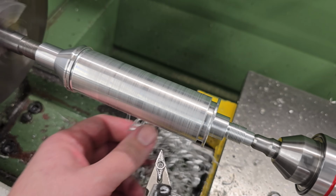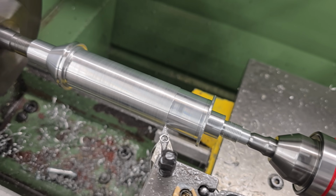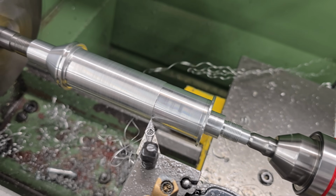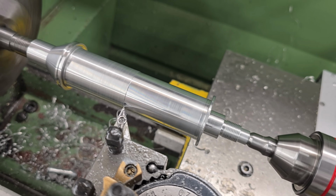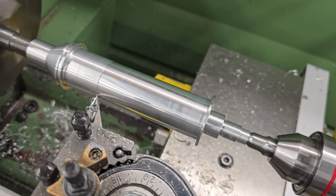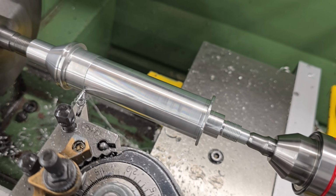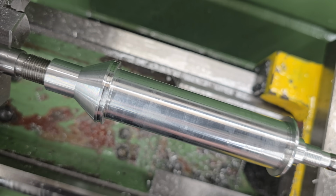shroud itself. In my experimentation with shrouds and moderators, the actual sound of the air hitting the side walls of the shroud or moderator also produces a fair amount of noise. To help reduce this, putting a layer of felt around the outside just helps insulate the metal or carbon fiber shrouds and makes them a little quieter.